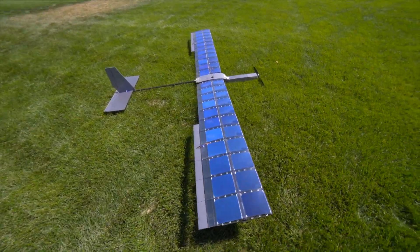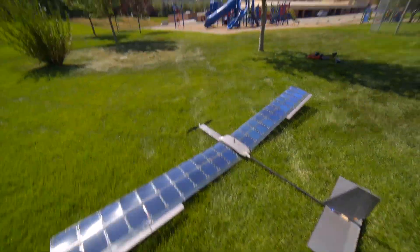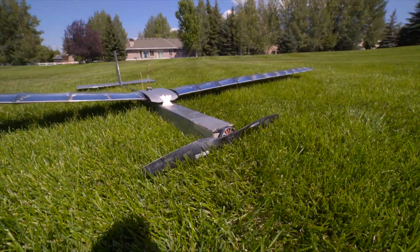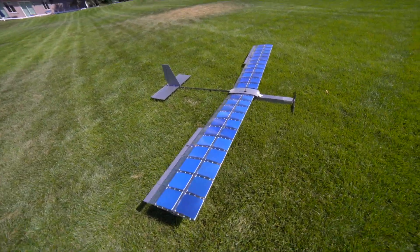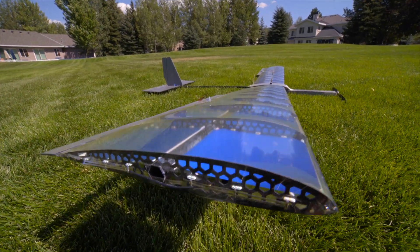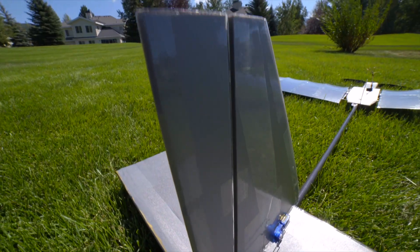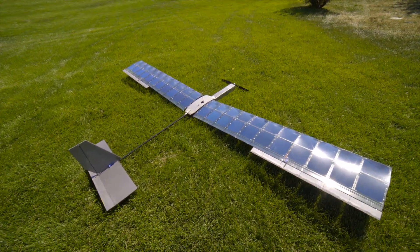All in all that was a good, successful test flight. The reason I had to land was that it got too turbulent and windy and the plane needed more power to stay aloft. I'd say between about 11:30 and 12:30, when it wasn't very windy and the sun was directly overhead, the solar cells were generating enough power to sustain flight — just barely. But if those conditions had persisted it would have been able to sustain flight, and it did do so for a little while. That was a 4-plus hour flight so something's working.